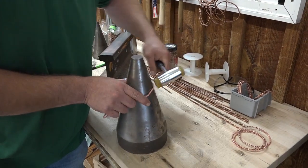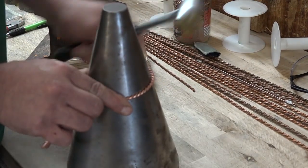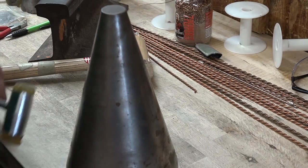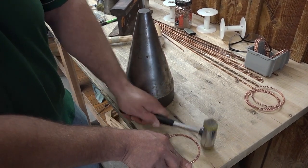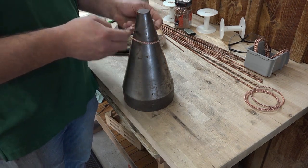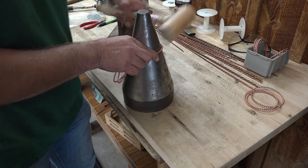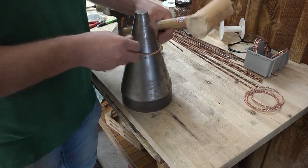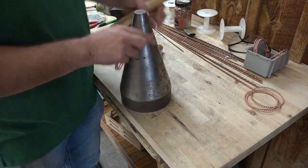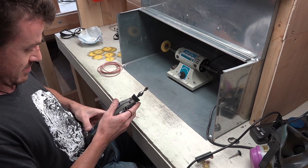When you heat up copper, it makes the crystalline structure shatter and expand — the copper becomes softer. So when we are hammering here, we are bringing the crystalline alignment back into the copper that was heated. Not only does it harden the copper, but we actually hammer the entire ring of every ring that comes through, just to ensure that all the crystalline structure is aligned.